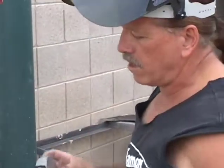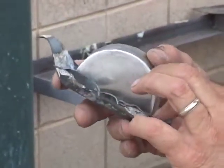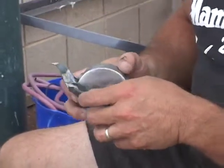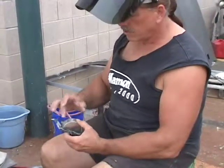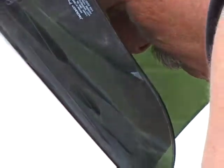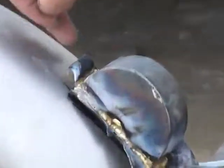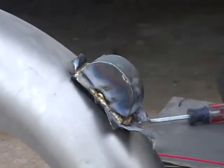Now that I've got the rip-away done and the puck done, I'm going to take and tack weld in the corners of each side, enough to secure it. Then I'll take brass and braze around it. The reason I'm using brass as opposed to welding all the way around is that a full weld bead would take a lot of excess grinding to get it smooth. I want it to flow. The way to flow it will be using brass, because the brass will meld in similar to solder — but the brass is a lot stronger. It'll flow into these crevices and seal it all up real nice and tight. It'll be a solid unit, and I'll still be able to weld it to the fender. I'm going to lay a bead of brass around the outside of it. By leaving the outside melding in, it'll look like everything is kind of formed up and came right out of the fender — give it that natural rip-away.